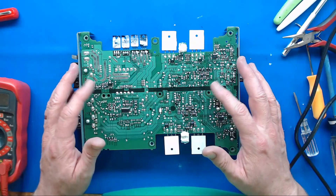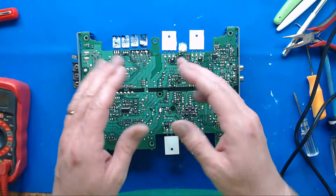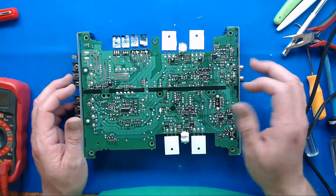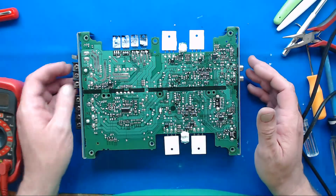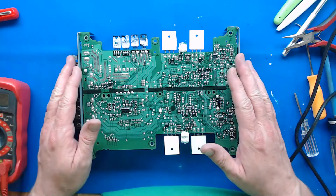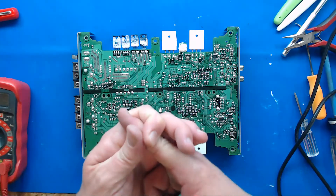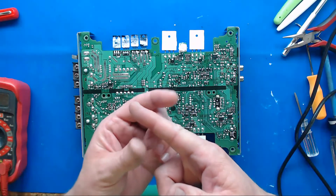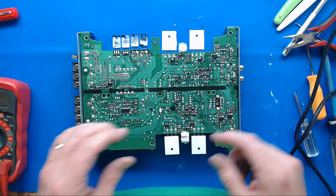The lead does a better job of wetting, and if you've ever messed with lead, you know it's a little bit more malleable than just the regular solder. Older amps that had leaded solder actually are a little less prone to vibration damage because the lead in the solder is a little more malleable on that joint, and it won't break apart and end up wiggling inside the hole.